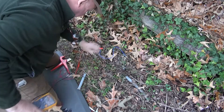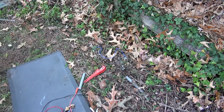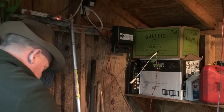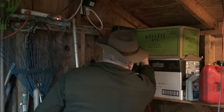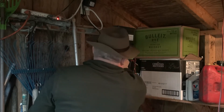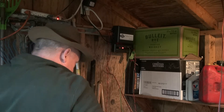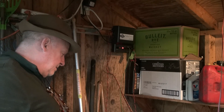I've got the connection made — hopefully it's restored now. I'm going to hook it up and see if it silences the alarm. I can hear the alarm going off, but I don't have the loop connected at the moment. Getting ready to tie it in. Oh yeah, success! We've got the red light there and that indicates a good circuit, and the alarm has stopped sounding. So sure enough, the weight of the tractor was enough to break open the conduit and damage the wiring. A quick fix.